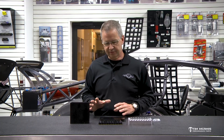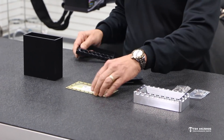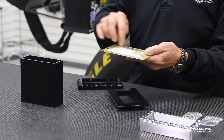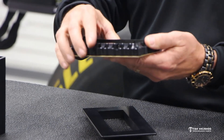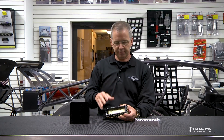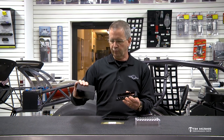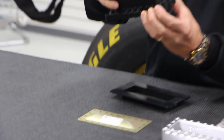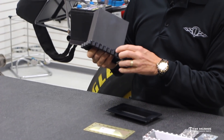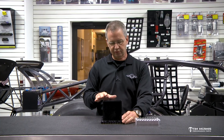So what we've got here is that design. If you've got an engine that has the provision for the burst panel already, you may have a burst panel similar to this with a little ring around it that basically clamps it down on the top of the engine, and when it lets go, it blows right up underneath the hood. What we've designed is more of a modular piece so that it's adjustable for a lot of different applications. Basically, you would take that ring off and then you have this base plate that we designed, which will accommodate this chimney. The chimney stacks right on here, and the kit comes with four button head bolts that come through and bolt the chimney in place.